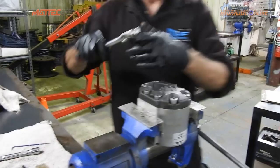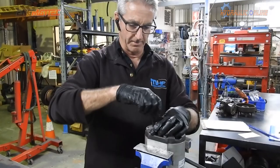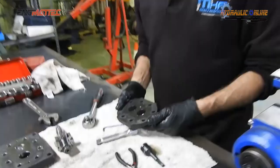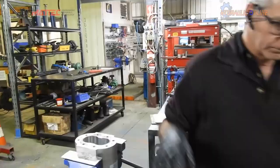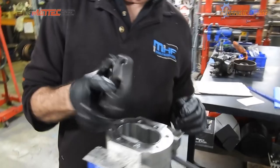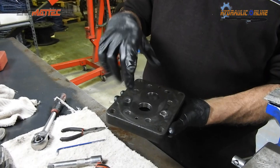The same again on this side — same size, same length bolts as the other side. The problem is about mixing them up. This end cap doesn't have any pins because it's not necessary. Those pins are actually for this end cap that has the hole, which basically means the pins actually line up and keep everything in line for the shaft to actually come through.